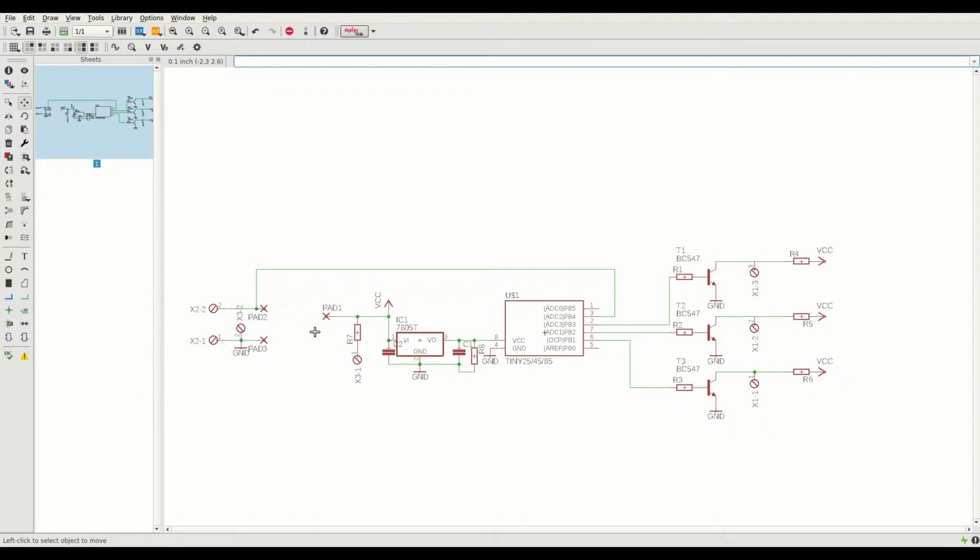So yeah. Boost converter is here, battery comes in here, this is the tabs for the LED to come off. The LED is on as soon as the circuitry is on, the switch goes in between here, between the battery and this. Then here, directly taken off the boost converter, there is a 5 volt regulator. That's a bit abusive, but I'm only taking, what, a milliamp or so, I can definitely get away with using just a linear regulator here instead of another boost converter.